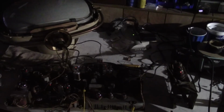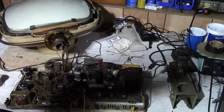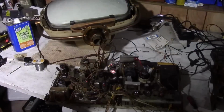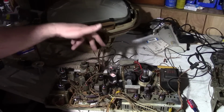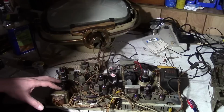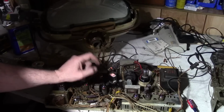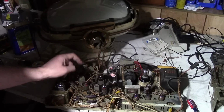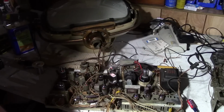I'm also amazed that the power switch is good. I was just on the verge of giving up when I managed to get both tubes to light. Tube sockets on these Predictas can be a little flaky. I had to tighten up the filament pins on the damper tube by bending the metal a little bit, so I definitely want to be replacing that one. And I think the same for this one. Also, this tube is really dim, so it's hard to tell when it's lit. But every tube is lit up as we speak.